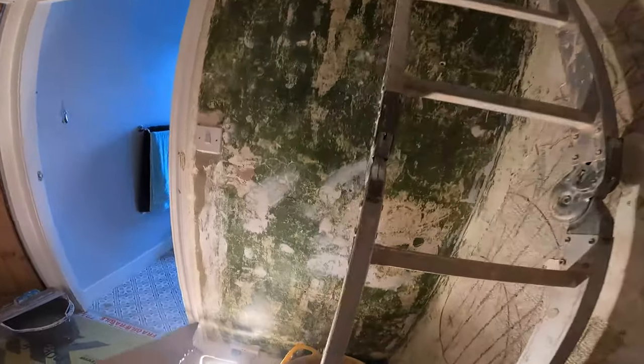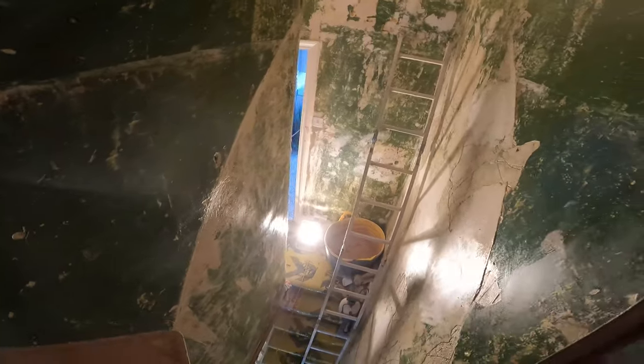Oh, and as I was saying, the gear that I had left over after I managed to get this ceiling on, did also the wall that the other ladder is now leaning on. And what I do when I coat that wall up, and where the ladder's leaning on it, I will push it off with my back, trowel some plaster on there, and I'll rest the ladder back onto the wet plaster. And although that obviously marks the plaster at stages as it's drying and I'm troweling up, I will pull the ladders back and I will fill over the holes with the plaster from my second coat, and with my fat when I'm troweling up. So although there's a ladder there, it basically gets the job done. And if there's any discrepancy at all at the end of that, I will go over it with a bit of fat from my next set, just to fill in any very minor things.